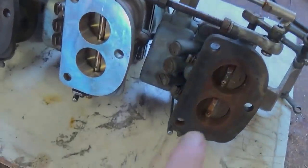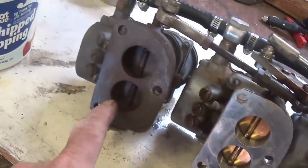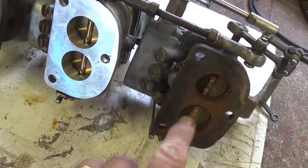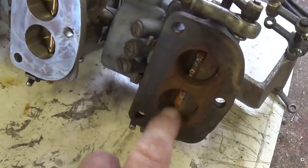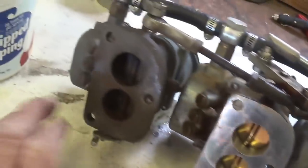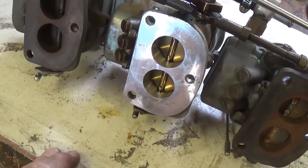This is kind of interesting. I'm looking at the bottom of the carburetors here. First off, this thing looks like brand new. It's just beautiful. I thought they probably had to remove the butterflies from the outer carburetor so that they wouldn't hit those block-off plates and interfere with the movement of the linkage, but they're recessed in so deep that they were able to leave them in place. So these are absolutely complete and operational carburetors, which is great. Okay, once again, a nice discovery.